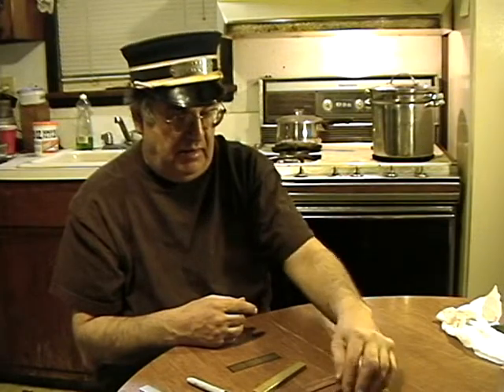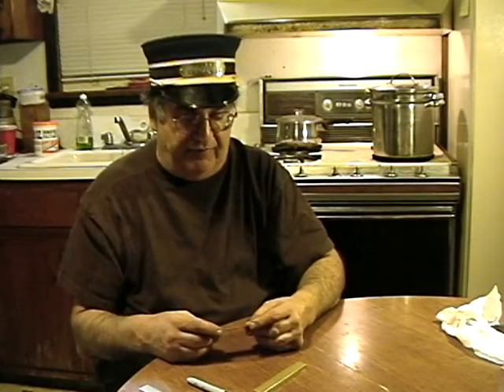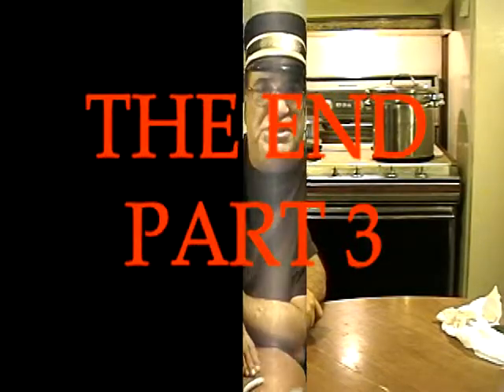I even made little dimples where it needed to be drilled so I didn't have to worry about punch-marking it — there was a little detent for the drill, and that gave me my holes for the screws. It worked out pretty good. Without this process I'd have to have somebody engrave it. This is photo engraving — same thing, it's cutting into the metal, but using chemicals. The next phase will be to actually submerge this in the ferric chloride, the etching process will take place, and then we'll go on to mounting it on the brass and machining it to make the steps.